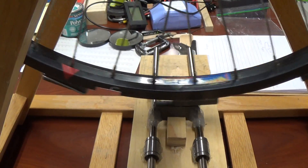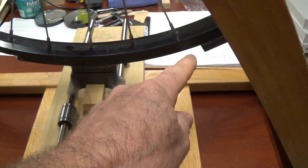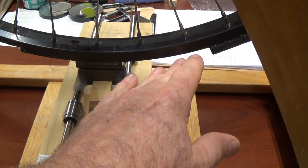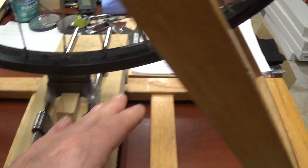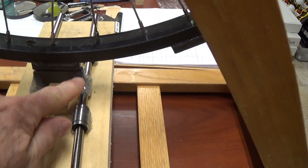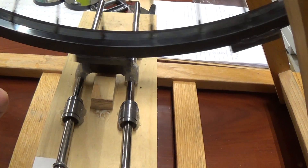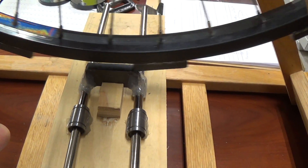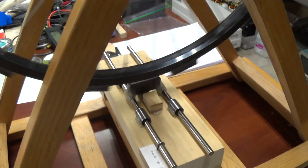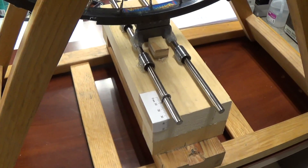What's amazingly exciting is I now have a motion happening back and forth with a wheel, and I have 12 magnets on this. You'll also notice there is a gap between the magnets — I found this was actually the most efficient, rather than having magnets north-south north-south right next to each other. With this spacing, it turns like nothing; you can turn it very easily, yet the force always seems to be constant.